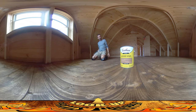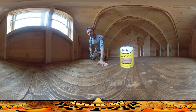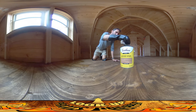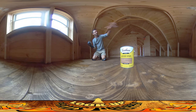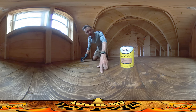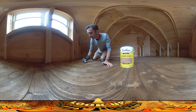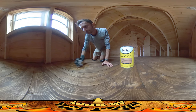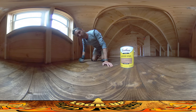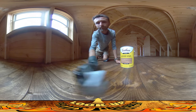With about an hour and twenty minutes left, I want to do the entire floor again with a second coat of stain. I decided I didn't need a sanding pass — the second day after putting the stain down I came through with a cloth, buffed it out, and got really nice contrast between the lighter and darker areas of the wood. I'm going over everything now with this light golden oak stain. Just watch — I'll put it down right here in front of you so you can see the difference.